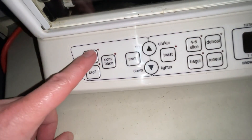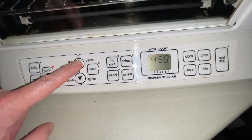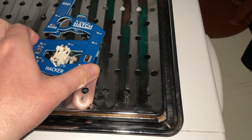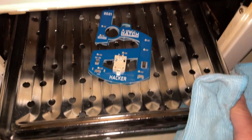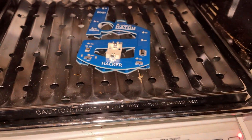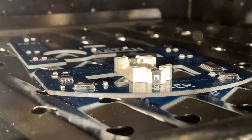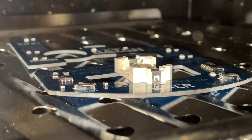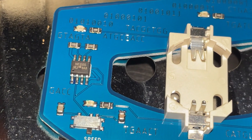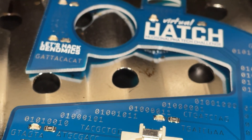The next step is to melt the solder. I use a toaster oven because it is super easy. I use the convection bake mode and set the temperature to 425 degrees Fahrenheit — this is a Cuisinart TOB165. I carefully place the PCB onto the baking sheet and insert it into the oven. It is very important to be careful when doing this; if you bump the board, the components can move off of their location. I close the oven and set a timer for 5 minutes. Watch the solder melt and soak up into the pads — it is so satisfying to watch. After the timer, I open the oven, slide out the tray to start cooling, and check the components. This is the best time to fix component placement if something got messed up because the solder is still hot. But this time everything looks great.